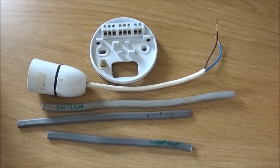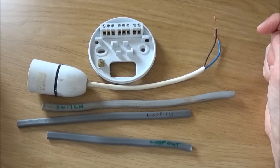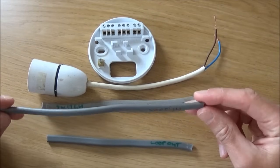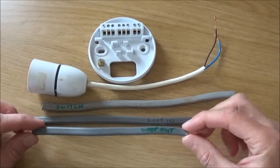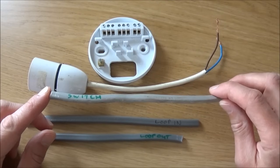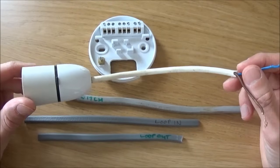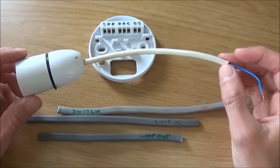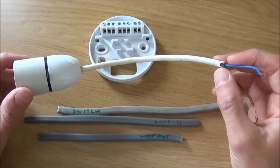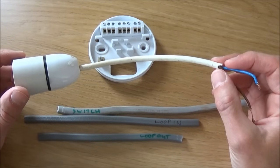To make this demonstration more simple I'm going to do this on the table, but in reality this piece of the ceiling rose would be the bit that is screwed into your ceiling. In a standard ceiling rose setup you're going to have four cables: your loop in — power from the consumer unit or previous light; your loop out — power taken out to the next light in the circuit; your switch cable going from the ceiling rose down to your switch; and the cable that goes to your light or luminaire. On a traditional ceiling rose you'll notice there's no earth on the pendant cable. If you want to know how to wire a more modern ceiling light including an earth, please watch my other video 'How to Fit a Ceiling Light — Lighting Circuits Explained' — there'll be a link on screen and in the description below.